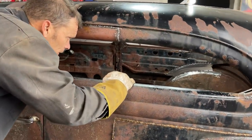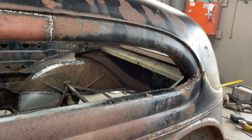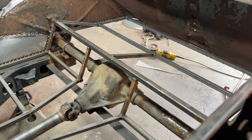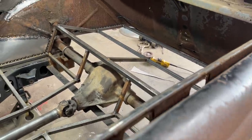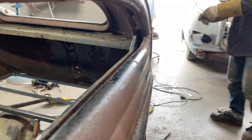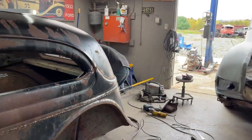All right, so our aluminum floor is going to run back to the top of the square stock, and then that's it. We're closed off from there down. We will not need anything. We'll weld that all up along that edge. We'll make two pieces, one piece for this corner, one piece for that corner. Then the back of the car is completely tied in to the car. Back tied in.